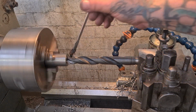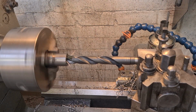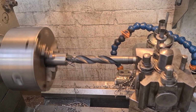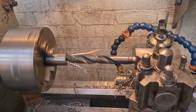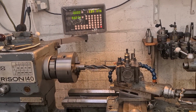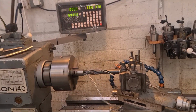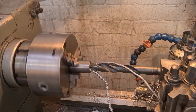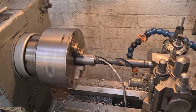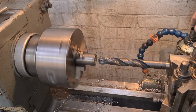Use a power feed. So far, so good. So we can use a power feed, nice and steady, and a pull out look. You can see we've got a DRO set as well. So we set that to 60, and as it approaches 0, we know that we're nearing the bottom of the hole. Simple. So once we get a build up, we'll go down about 10mm at a time, and we knock the feed off, just clear the chips.